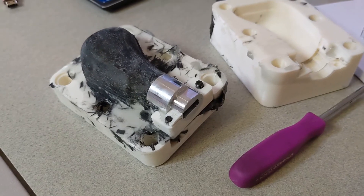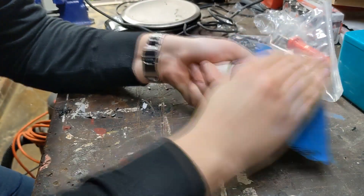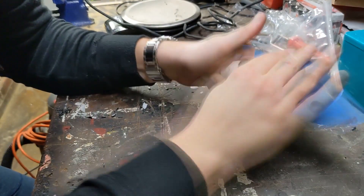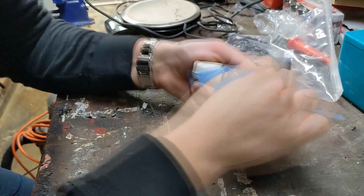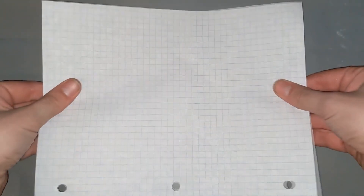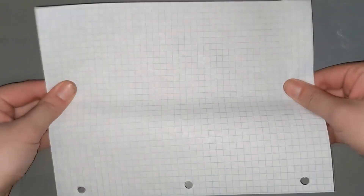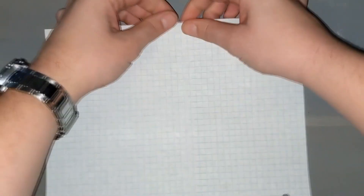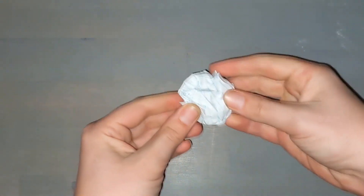Let's talk about why you might want a forged carbon fiber part over a more typical carbon fiber weave component. At face value, it's less strong than woven carbon fiber and arguably less aesthetically pleasing, but just because it isn't as strong doesn't mean it isn't still a strong material that can produce lightweight and functional parts. The main benefit of forged carbon fiber is that the strength of the part is more or less uniform. An example I like to use is a piece of paper — woven carbon fiber would be your regular flat piece of paper, great as a 2D part, strong when you pull on it lengthwise, but it can bend and tear pretty easily. However, if we crumple that paper up and suspend it in epoxy, we now have a part with uniform strength in all directions and we can make more 3D parts with it.